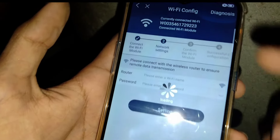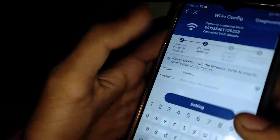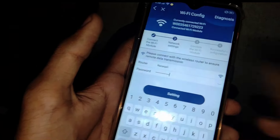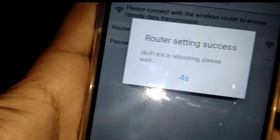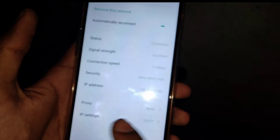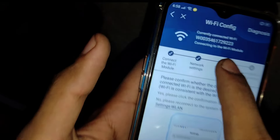Open Wi-Fi on your phone. If you haven't logged in, you can refresh it. Click on the network, then enter your home Wi-Fi password. The inverter is going to reboot. You need to connect to your home Wi-Fi. Also connect through the dongle Wi-Fi setting to link the dongle.